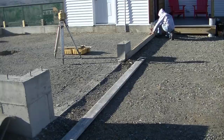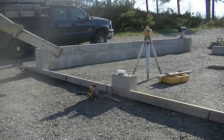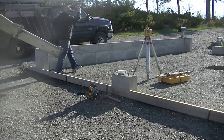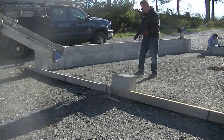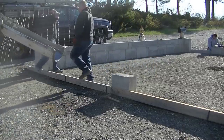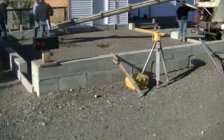I'll have a link for that DeWalt drill down in the description, as well as the laser and all the other tools we use. So now I'm just putting the Tapcon in there, and I'll also drive in a couple of metal pins to hold the board too — so this is all pre-pour. Now the concrete showed up, he's mixing up, and we're putting in the wire mesh. We also got fiber mesh in the concrete, so we're using a 3500 PSI mix today on the garage floor with fiber mesh.